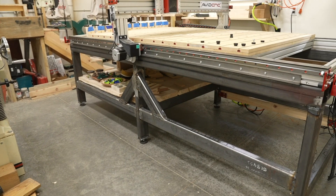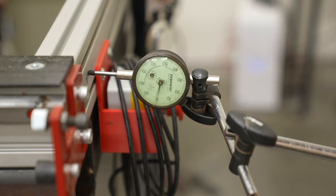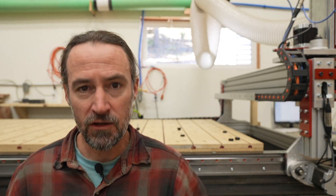Finally I got all the pieces welded on and the table cleaned back up. I did another shake test running the same program as before. The movement arc is now about five thousandths of an inch. Originally it was getting about ten thousandths of an inch during the air cut and up to seventeen thousandths during the rapids, and now I only see it move about five thousandths at any given time. This is a huge improvement and I'm pretty happy with the results.